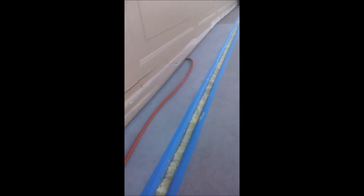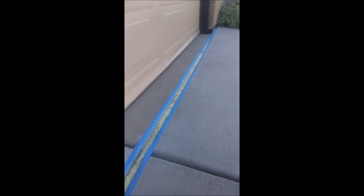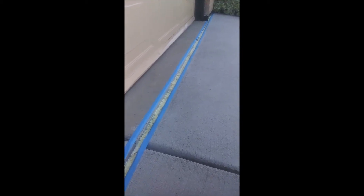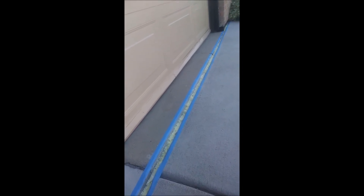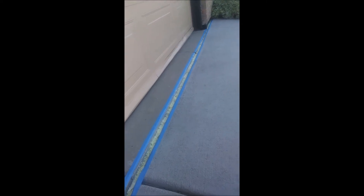I'm going to go through and pick out any high spots in the foam, then come through and really finish this thing up. I expect a pretty nice result except in places where the concrete is higher — it's going to look a little funny there. But it will be sealed. This is about the only way I could think of to really permanently seal this, because caulk alone won't do it — the actual foam is making a seal too. Look how sticky that is — I don't think you can get water through that. The ultimate goal is just to stop water penetration altogether.